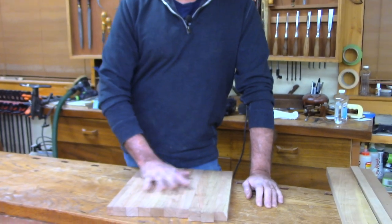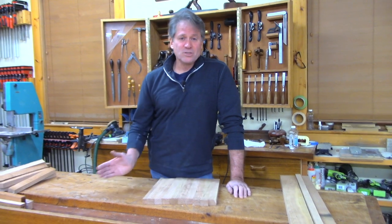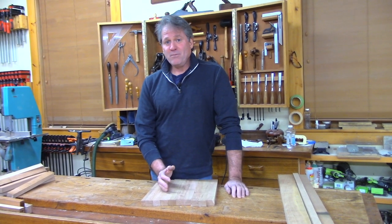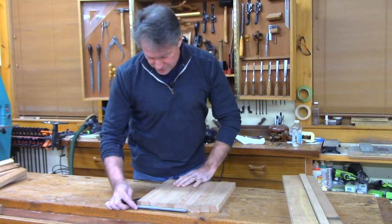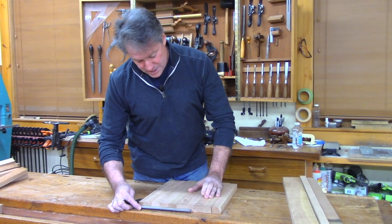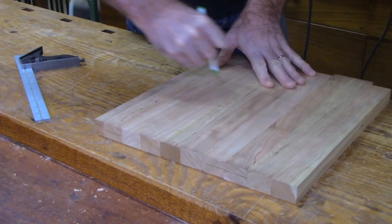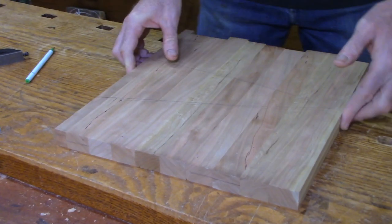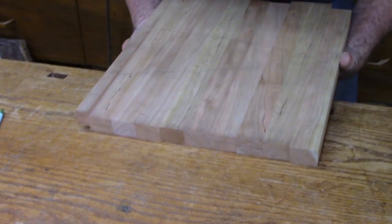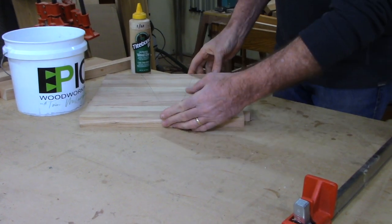This is a board that's harmonious — it's all one wood, all cherry. You could mix this up if you wanted and throw some walnut in there, or some maple, or whatever. After I've got these arranged, I roughly square one end and then I put an orientation line on there. Now I know I can get these back in position. I'm going to take these over to the glue-up bench. This is the first glue-up — we're just gluing them all to make one large panel.